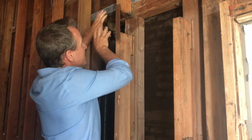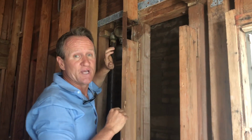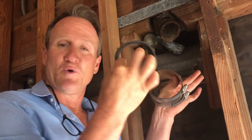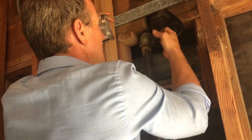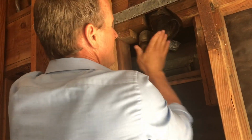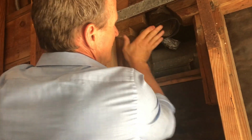So what we're gonna do is we're gonna start right here. We're gonna put in a 45. I'm gonna show you what that looks like right now. All right, folks, so we're gonna go ahead and remove the rubber seal. Go ahead and put it on your first connection, which is on this 45 here. I like to kind of open it up a little bit too. Makes it easier to get the fitting on.